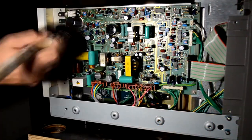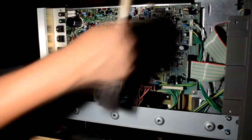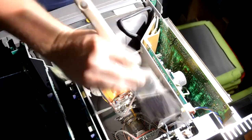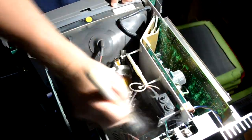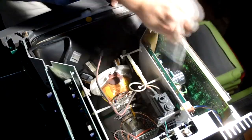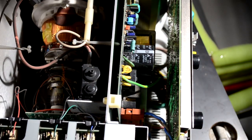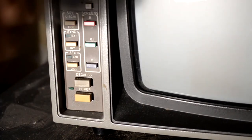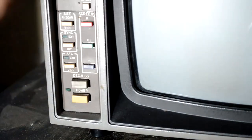Adrian did not want to do any cap work on this monitor as of yet, and I don't blame him — if it works fine and you don't want to invest a huge amount of money into it at the time, it's fine to go in and clean and adjust without doing a cap kit, at least not for now. I want to get in there and knock the dust off the yoke and the tube. I'm using a clean paintbrush with non-conductive bristles, which is really effective for cleaning and knocking dust off. We want to get that dust out so it doesn't act as an insulator for heat on our circuit boards and cause components to fail.